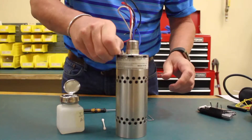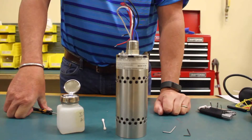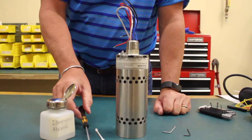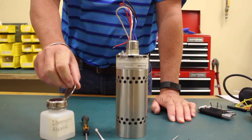Once it's all cleaned, you'll want to power the sensor back up for 30 minutes to an hour and then run it through its zero and span calibration. With these simple tools, you can clean up the Millennium sensor, recalibrate it, and it will be good for quite a few more years of operation.